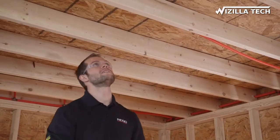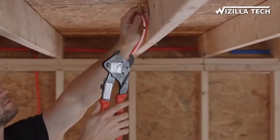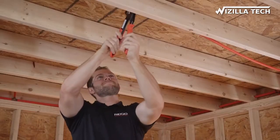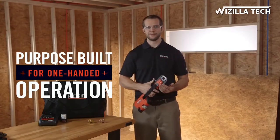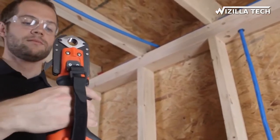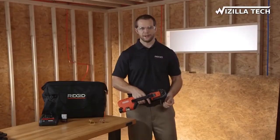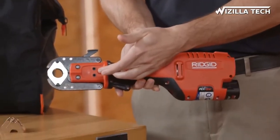If you've been pressing PEX, you know the struggles of using manual tools. These tools require two-handed operation — you need two hands to open the tool, an additional hand to keep the fitting in place, two hands to make the connection, and two hands to back the tool off of the fitting. The PEX-1 changes all of that. This tool is purpose-built for one-handed operation. Simply slide your hand under the strap and tighten for greater control in overhead spaces. If you're a southpaw, just flip the metal piece at the front of the tool to the other side, and you are good to go.